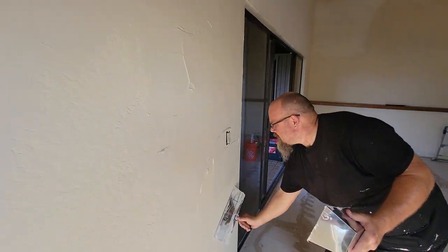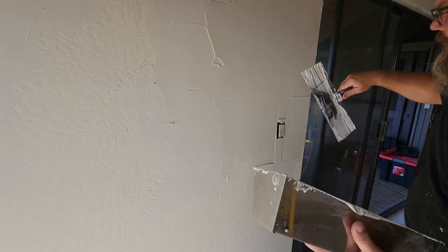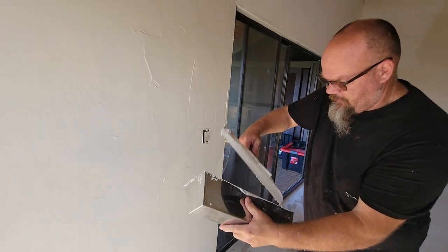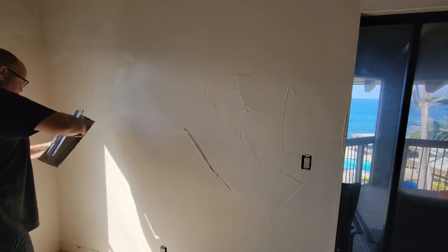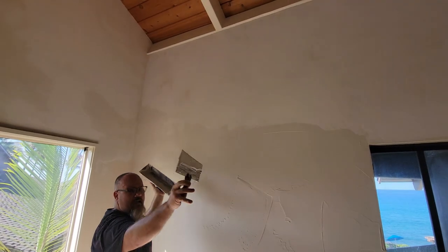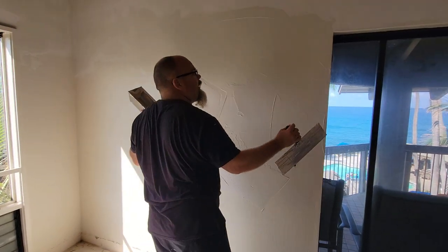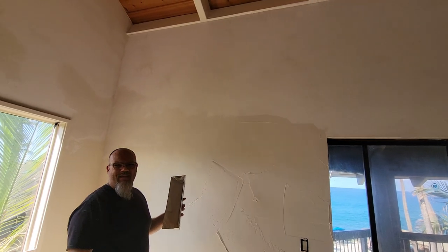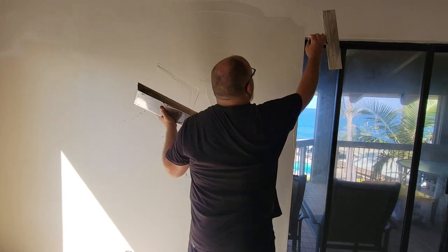When I go around plugs, pull your plug covers off and don't touch those screws with your trowel — you'll get a shocking experience. Remember, I can sand too — anything that's too nasty or too heavy, I can sand. I do sections — a section at a time, working from the top down. The reason I go from the top down is because if I went from the bottom up, any drip is going to roll down the wall and kind of mess up all the texture I did.